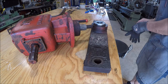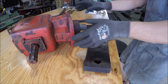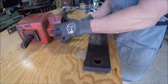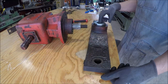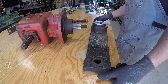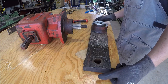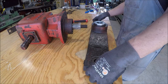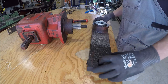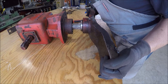Well, I am glad I shrunk it. I know the standard is usually about 1 inch for every thou press fit. So technically this is 2.9 inches. We should have done a 3 thou press fit, but I was worried we'd have trouble since we have to go 2 inches down. So I only did a 2 thou press fit. And as you can see, we still struggled even freezing this thing, but she goes on there good. I don't think it's gonna be an issue.